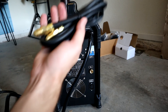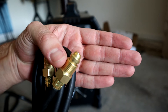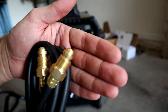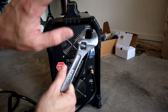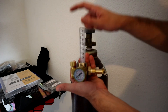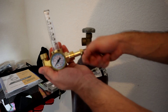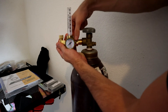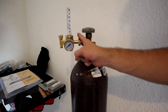Now let's talk about the argon gas connection. They've included a nice crimped cable. These actually don't need any additional thread sealant - they're designed to seal around the opening they plug into. You don't want to make this too tight, but I'll just snug it down a bit with an adjustable wrench. The pressure regulator included with the kit has fittings machined to seal properly, so no pipe fitter sealant needed. Make sure your gas is closed, thread it up, and snug that a little bit with an adjustable wrench.